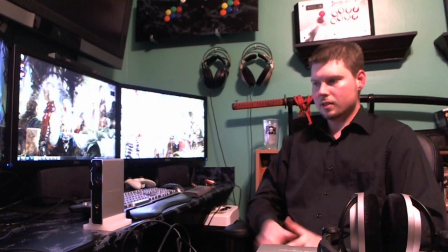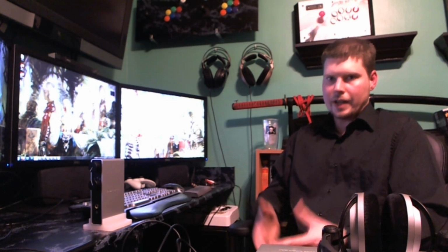The next thing is the DAC. And a DAC actually is another acronym. It stands for Digital to Analog Converter. And what that really means, in the simplest terms, is that it's a sound card. When you're playing something off of your computer, everything on your computer is a digital source. It's a digital file. And it has to first convert that digital file into an analog signal so that your amplifier can turn it into sound for you.